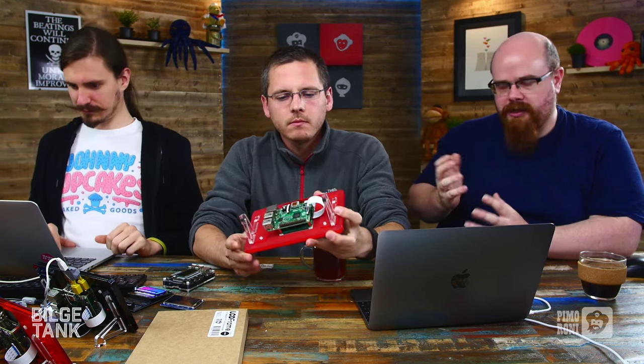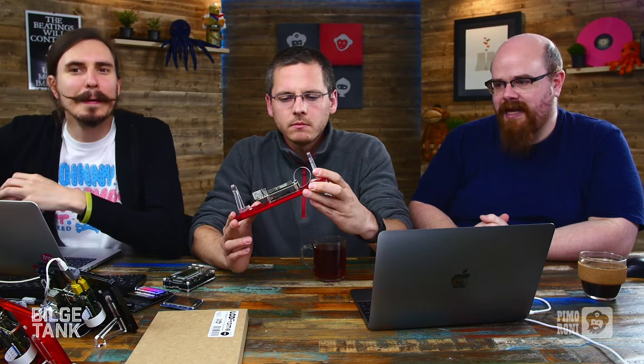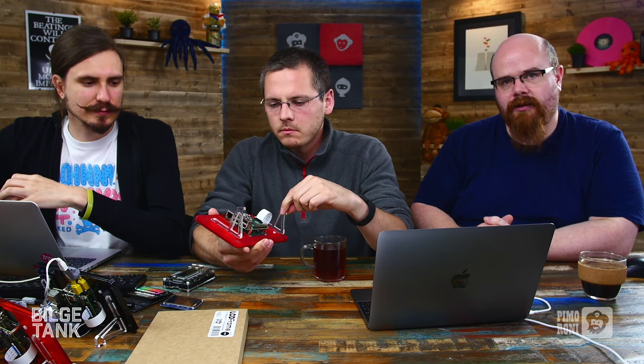So it should be okay. Currently this is going great guns — everybody's getting these because it's been anticipated for so long. If you go to the Pi website, there's a brilliant long post from Gordon about all the trials they've been through getting this to market. One of the big things has been EMC, so your display doesn't turn into an unintentional radio or microwave. Because it's a bare board with some very high-speed signals, it can unintentionally become a noisy piece of electronics. But through good design and electronic engineering, they've achieved Class B compliance — the best class — so it's now tested, approved and released. You can get it on the Pimoroni store with a nice stand or the swag store.